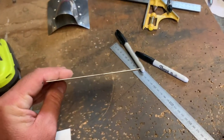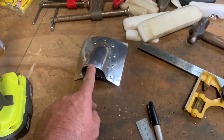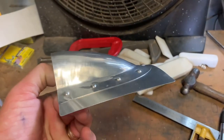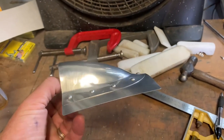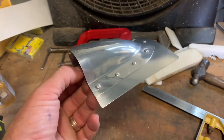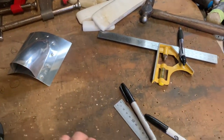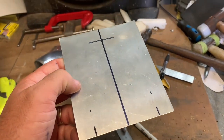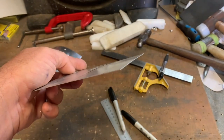For this demonstration I've got a piece of 5005, 0.8mm - so that's about 30 thou. It's different material to what I used on this piece, which is 7075 T6 at 16 thou. I just wanted to demonstrate how far you can stretch this material as opposed to folding it, because it'll split when you fold it. For this demo we'll use something you can buy at the local hardware store - it'll work hard and shape up to something I'd use on an aircraft, not as a structural piece, but good enough for an air scoop, headrest, or other secondary structure.